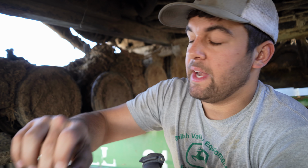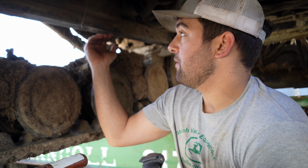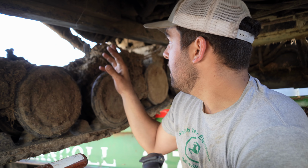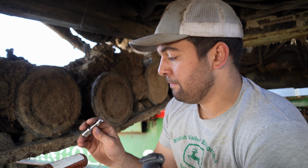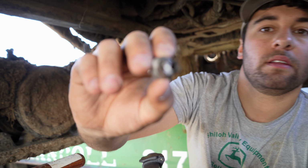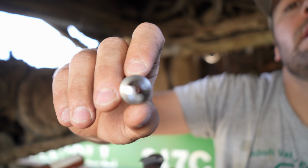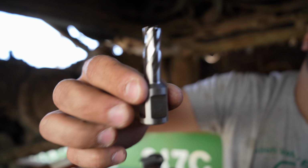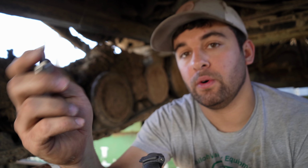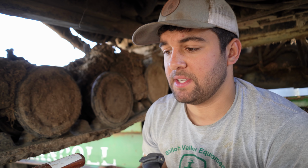So I think my next idea, I really hope this works, I've got this rail cleaned off, and I'm hoping I can get the mag drill to stick to it. There's not quite enough surface area for the magnet to sit perfect on it, but I think it'll go, I hope. And then what I'm thinking is we got these annular cutters that go with it. Get out of the shot. These annular cutters have a hole in the center, and I'm hoping that hole in the center goes around the extractor so it's not cutting into it. And I think it's going to work, because if we look here,